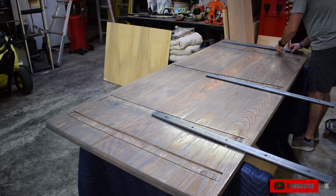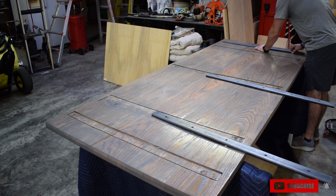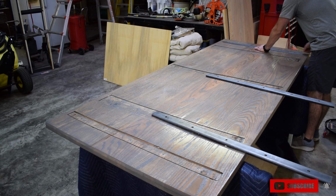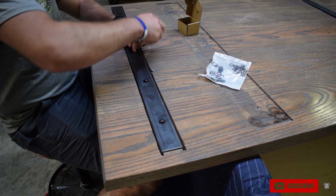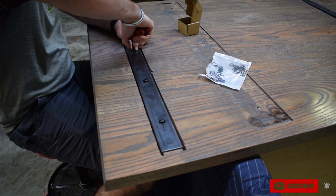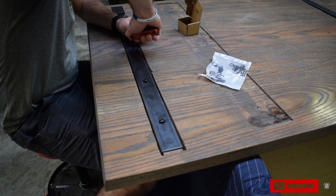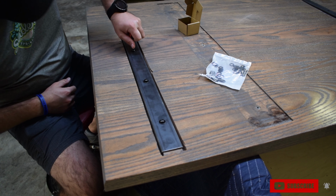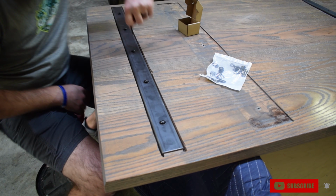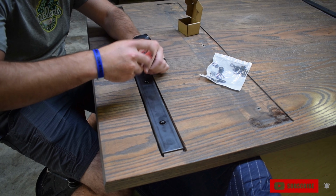With all the finish work complete, it was then time to install the C-channels and table legs. I wanted to include this clip just so you could see the process I took for installing the furniture bolts into the table. As I mentioned earlier, I definitely snugged down the center bolt in the center of the table, and the rest of the bolts, once I got them tight, I backed them off just a bit so that would allow the table to expand and contract.